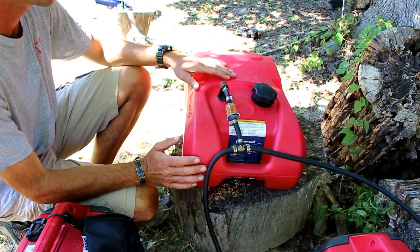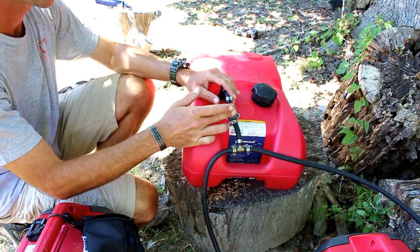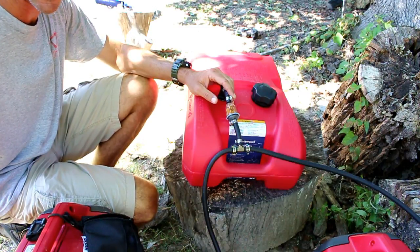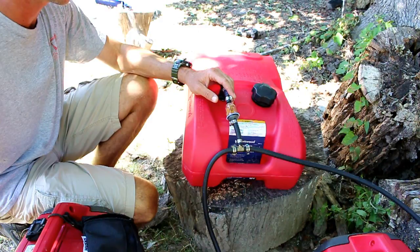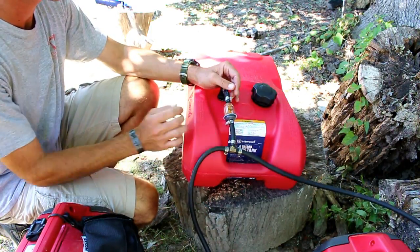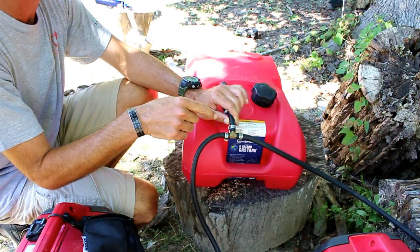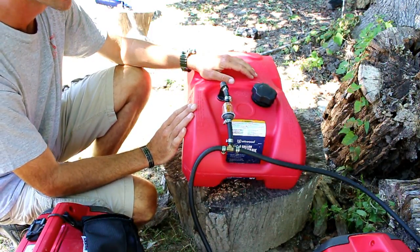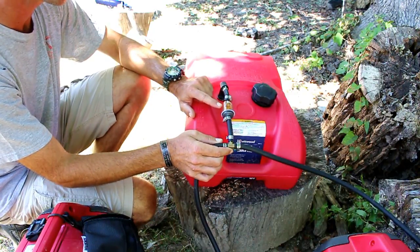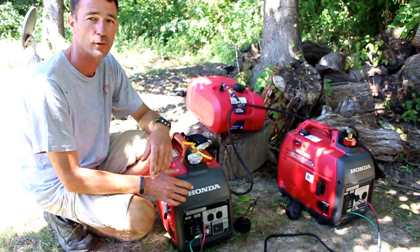For the external fuel tank — I ordered this off Amazon. It came with a six-gallon tank that originally had only one line going straight down. I bought an inline fuel filter, some extra hose, and some clamps. I spliced in a Y-connector so I can now run two hoses off of one fuel tank to power both generators. It's been working out great. Just remember to include this fuel filter on your maintenance checklist and change it out once a year, because you don't want contaminants getting inside and you want it to last a long time.